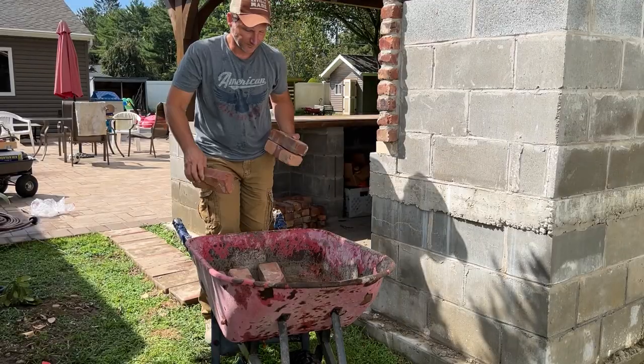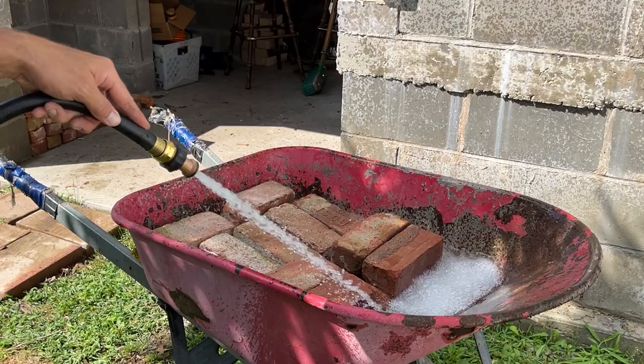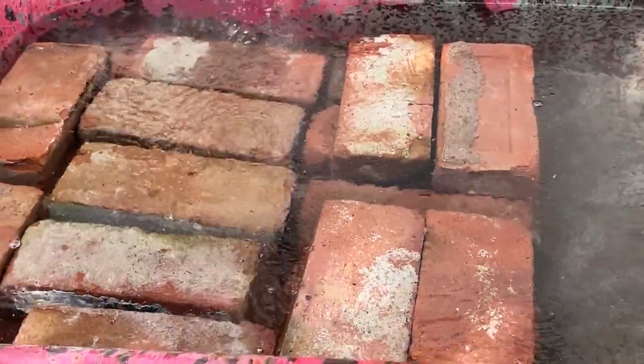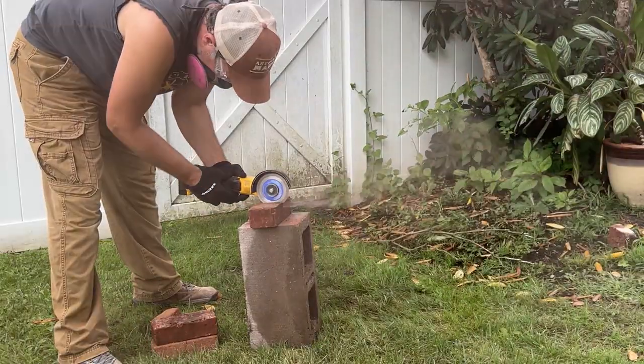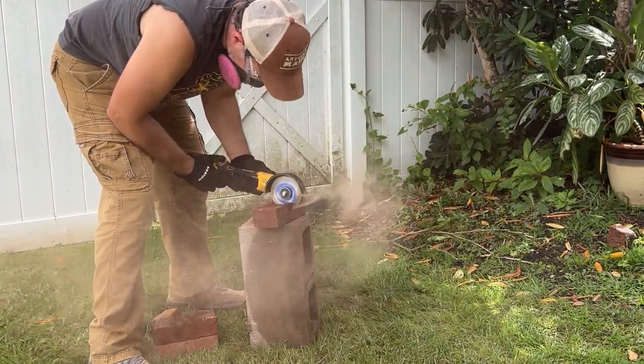First thing you need to do is soak your bricks, and I like to always pre-cut as many bricks as I possibly can before I start mixing mortar because it allows me to work a little bit more quickly. There are different methods that can be used to cut brick. I did a video on that. I will link it in the description if you want to check it out.